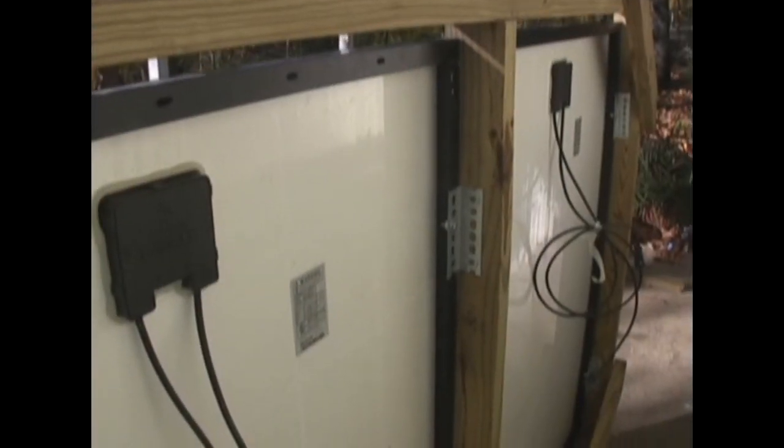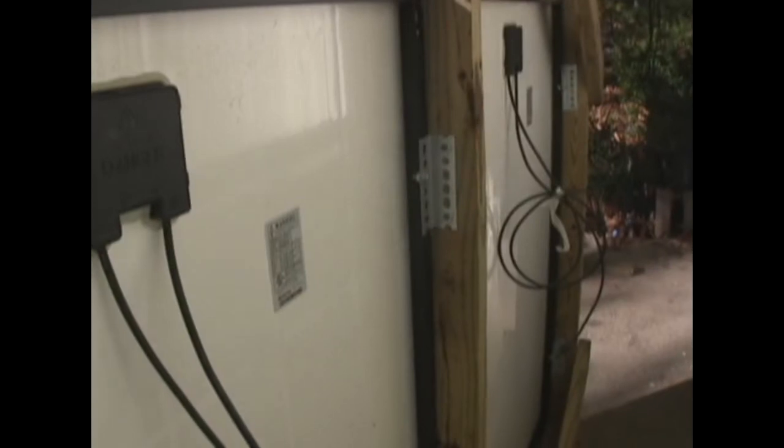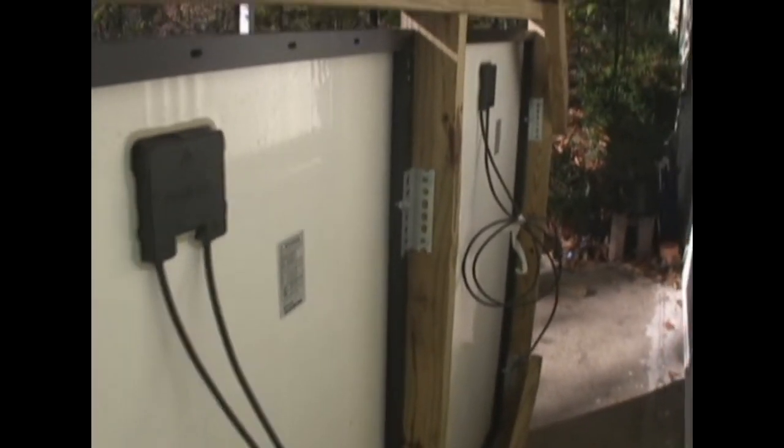Let's take a look at the back here. You can see that the angle iron mounting plates are right there in the four corners of the panel, corresponding to the four mounting holes which are already pre-drilled on the panel. You'll probably have eight holes total on your panel, allowing you to mount it in a couple of different places. I'm using zinc-plated hardware — keep all the hardware loose while you're working on it so that you can jockey everything into position, because your holes won't exactly line up no matter how you try. Then you can move everything around, line the holes up, and cinch it down tight.